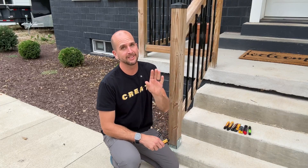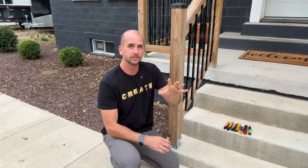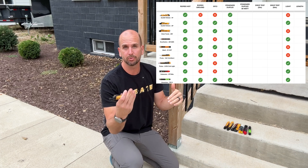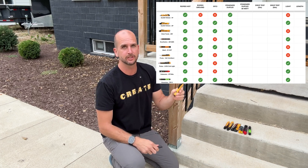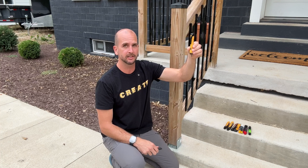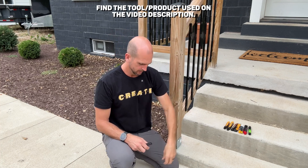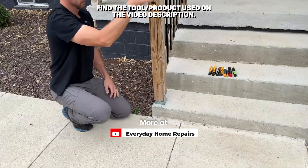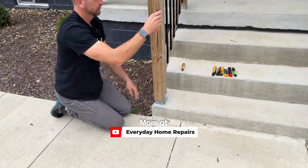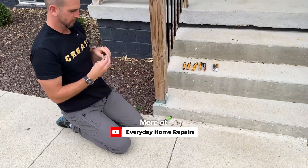We have all the results, which also include testing at the duplex outlet turned down to 80 volts. All results will be in a table including pricing and a durability test. The durability test involves dropping each non-contact voltage tester straight down so it hits the testing portion, doing that 25 times each, and then going back to test at the duplex outlet at 120 volts.